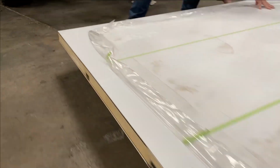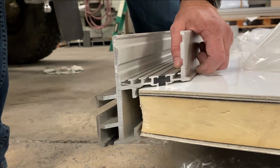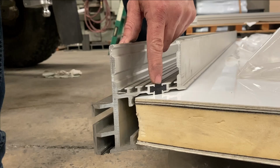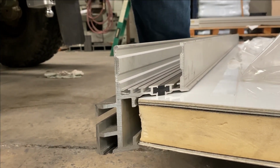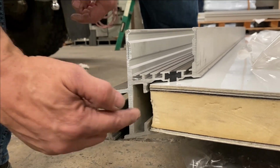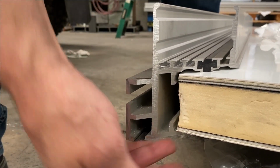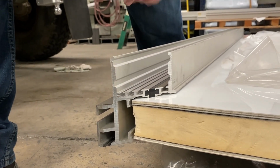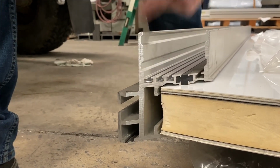Exposed 2.5 inches for glue. All right, so here's a cross-sectional view of a corner assembly. And what you can see here is a variety of things. Of course, the thermal break, the glue pockets that we're going to put glue, the Sikaflex, in, glue capture pockets, or optional glue pockets, a wire channel. This is for the 80-20. It'll be a corner cap that's going to come here. Glue channels for the vertical walls, load bearing channels for the wall to sit on. And that also lightens it up, but keeps everything strong.